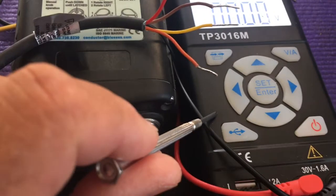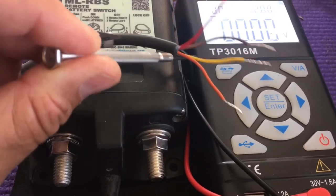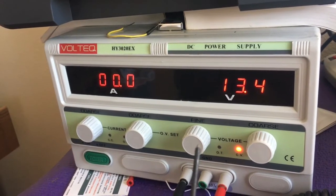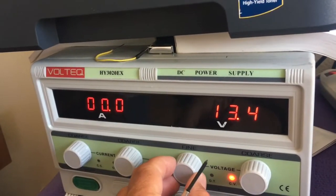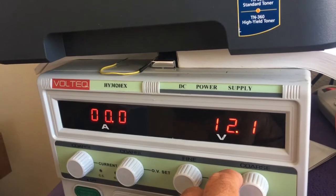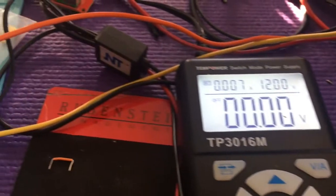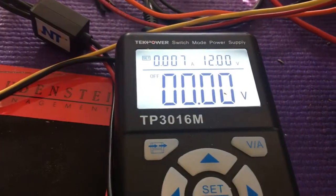The ground wires are going to be joined — common to both supplies. I'm going to turn this supply down to 12 volts, which is the worst case as far as voltage, and this supply is going to feed the red wire. We'll be able to read the amps off of it to see what the red wire is taking. For this test I'm going to be pulsing the orange wire on the relay.